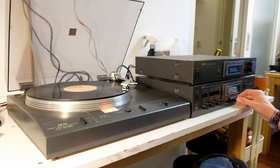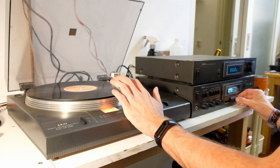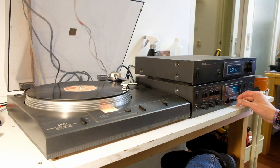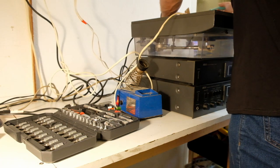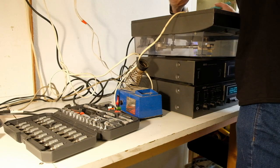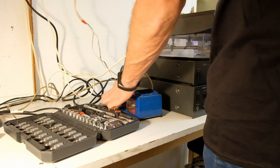This is very, very soft. Something's up with that cartridge. But that's not my main issue — my main issue is the speed of the record player. Let's see if it has adjustments. I'm heating up the soldering iron because I found a not strictly necessary spark killer on the verge of exploding, so I'm going to take that out before it does.